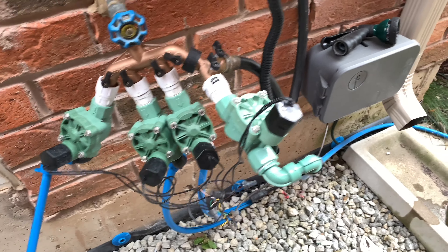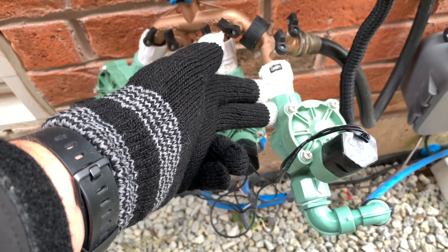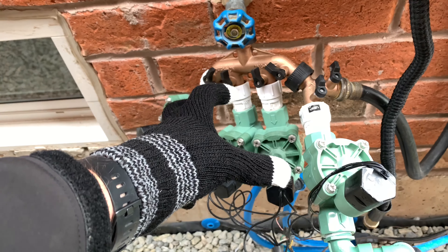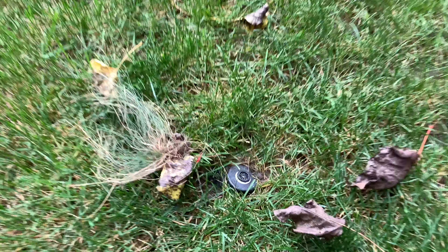Basically, you're supposed to just blow these out too — the actual valves. But I'm a little paranoid, so I kind of just unscrew it from here and bring in these four valves and leave the blue lines. What I'm going to do with this guy here is put it in the valve and blow it out, and you will actually see all the sprinkler heads pop up and get the last little bit of water out.